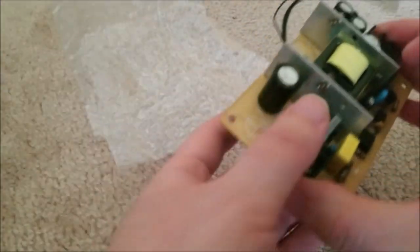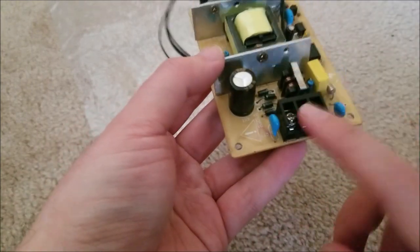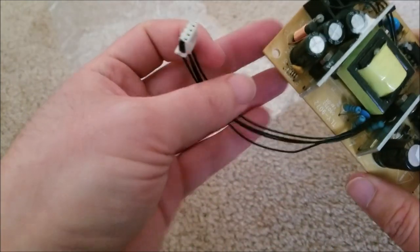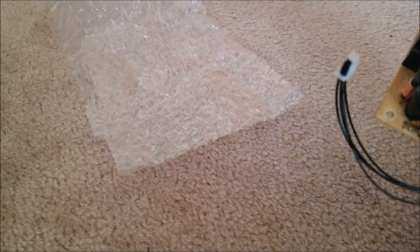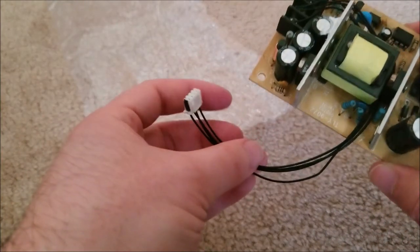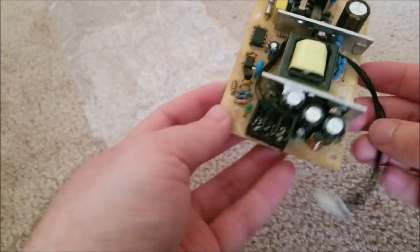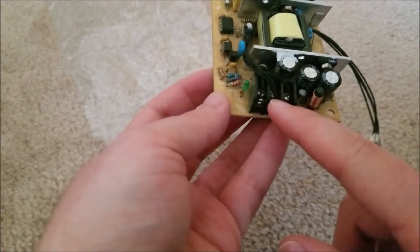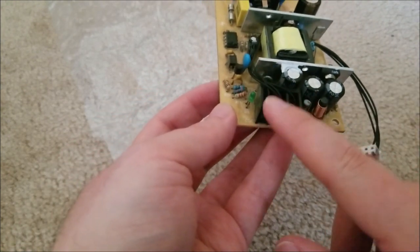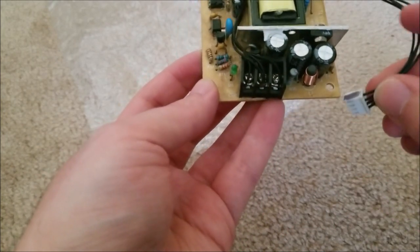And last but not least, we have another power supply. Looks like it's an ACN unit. I'm guessing this is to power one of the Galvo drivers — it's just gonna be a switching supply, probably dual polarity, like plus/minus 12 or 15 volts to drive them. So definitely cool, definitely going to put that to use.